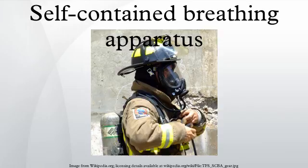An open-circuit rescue or firefighter SCBA has a full-face mask, regulator, air cylinder, cylinder pressure gauge, and a harness with adjustable shoulder straps and waist belt which lets it be worn on the back. The air cylinder usually comes in one of three standard sizes: 4-liter, 6-liter, or 6.8-liter. The duration of the cylinder can be calculated with this formula: (volume × pressure / 40) minus 10 in minutes. So a 6-liter cylinder at 300 bar is (6×300/40) − 10 = 35 minutes working duration.